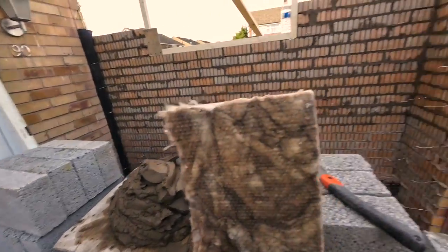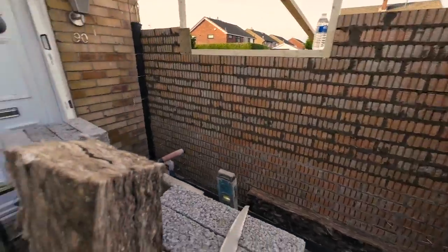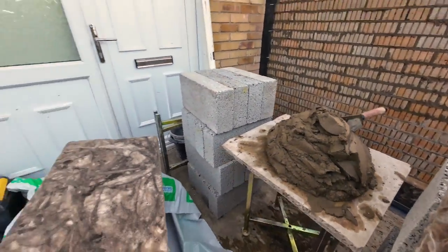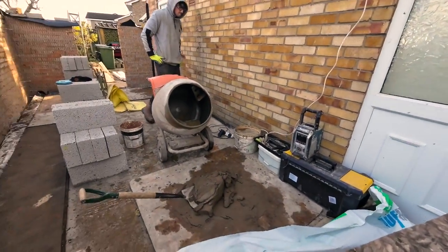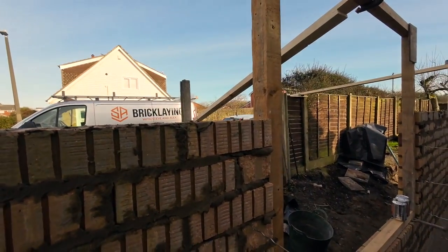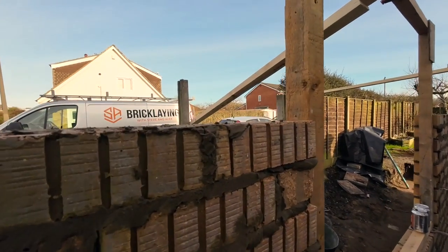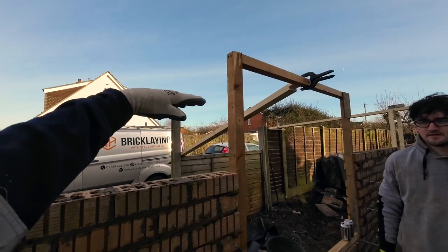So yeah, Alex is going to get me the cut stone. I'm going to get the insulation sorted out. I'm going to throw this corner up as high as I can get it until that runs out. Then tomorrow it's back here, blast all the block work up to 7 courses, so it'll be 6 coursing brick and another block set. So we'll be up here with the block.